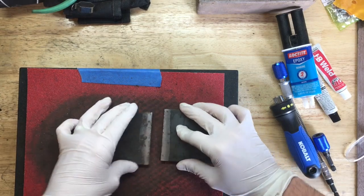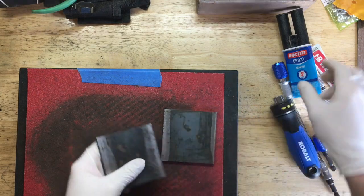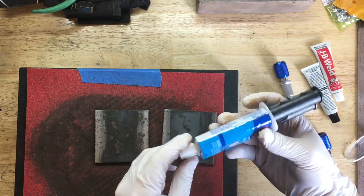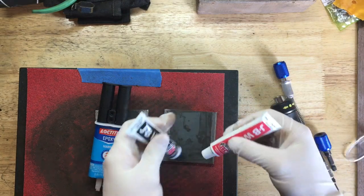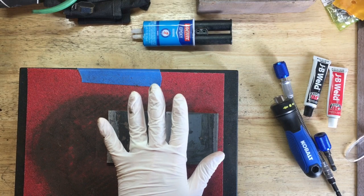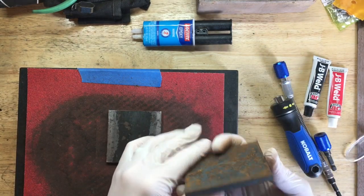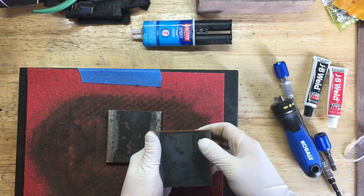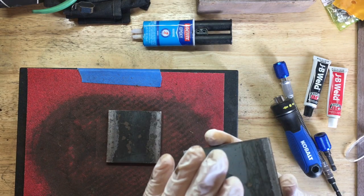We're doing this to rebuild the Atlas 10D lathe. We'll mix up some marine epoxy — this one is advertised at 3000 PSI and the other at 3900 PSI — and try to divvy out the same amount of molybdenum disulfide, then flatten it and test the angle at which it slides. I may also do a control to see if there's any difference between a mixture of molybdenum disulfide and epoxy versus just epoxy itself.